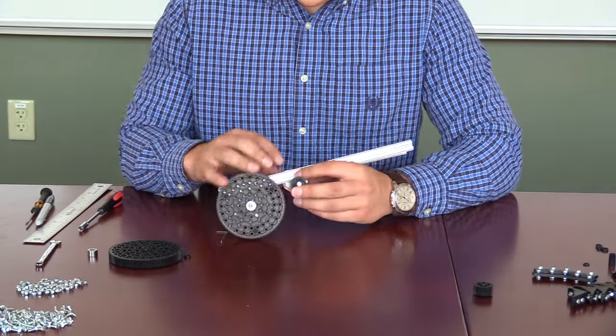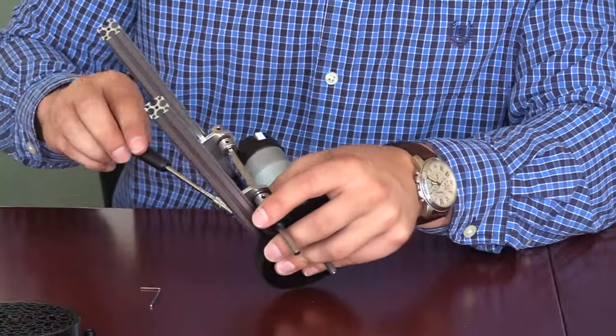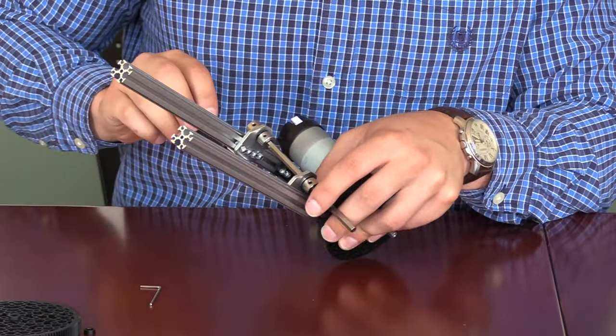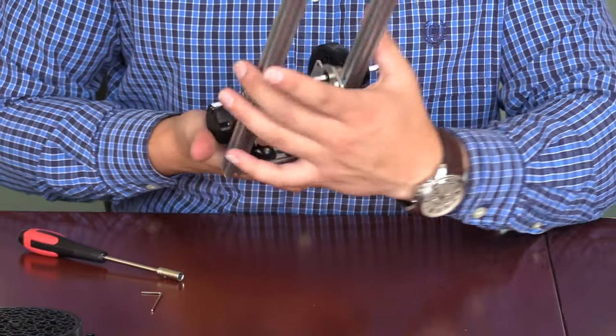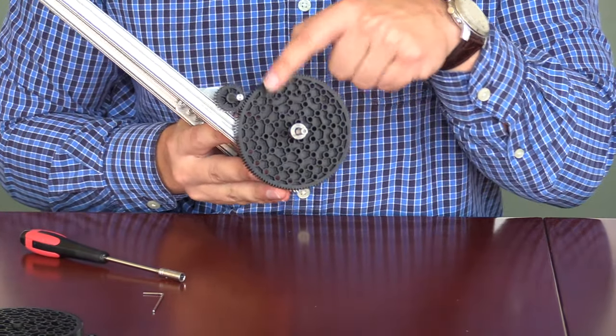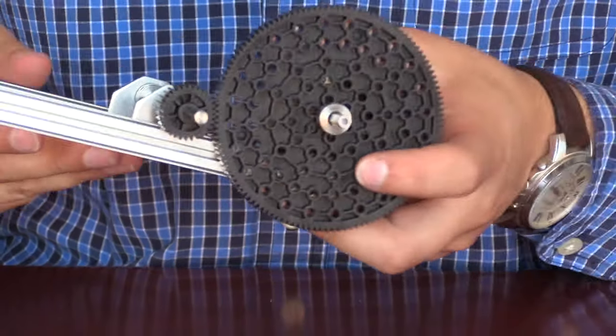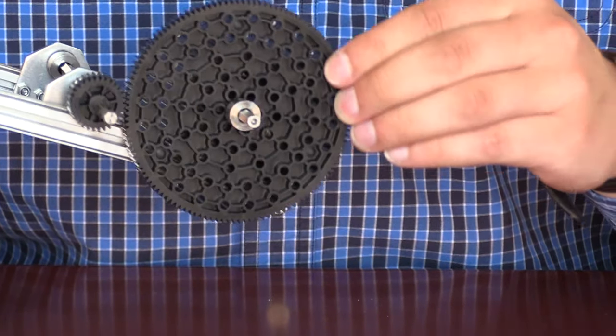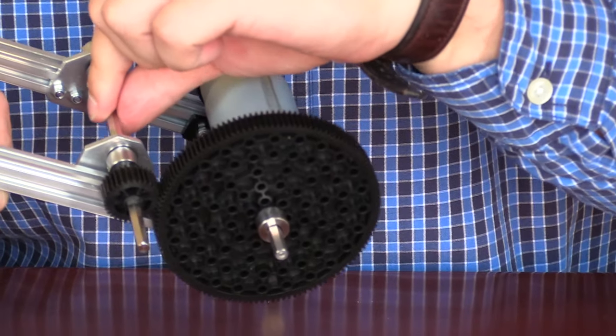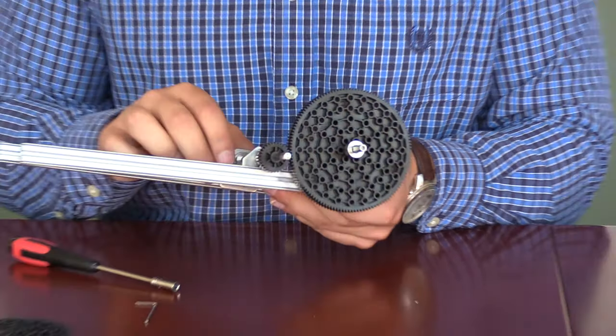As you're aligning the gears, make sure that you keep the two pieces perfectly parallel with one another. You may slip a little bit, but this will be important as we reduce the friction on the shooter. We can look and see the final product — the gears are meshed pretty tightly together. We can do a test by spinning the larger gear and seeing that the smaller one rotates. If for some reason things were locked up, we would undo the assembly and redo.